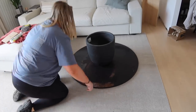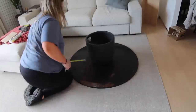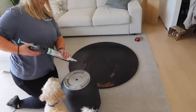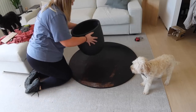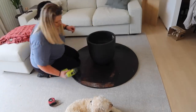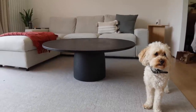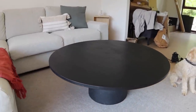To mark the base location, I placed the plant pot on the tabletop and used a tape measure to make sure there was equal distance all the way around. Once happy with the position, I drew a mark through the hole of the plant pot to find the center. I applied No Nonsense grab adhesive to the raised bits, flipped it over, placed it on the table using that center mark, double-checked with the tape measure, and screwed in the piece of wood for extra security. Once dry and fixed, I flipped it over to the finished result.